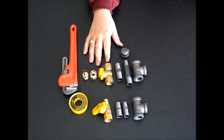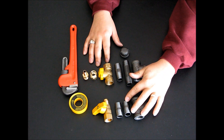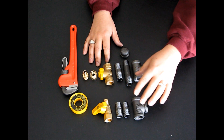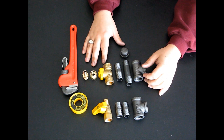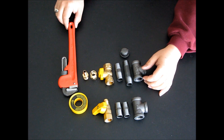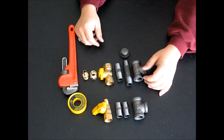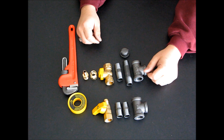Since I plan on running my dryer from this as well, I needed an additional ½ inch tee, two ½ inch by 1½ inch nipples, and a gas valve that allows me to screw on my flex hose from my dryer. In addition to all the pipe fittings, I needed to pick up a pipe wrench and the yellow Teflon tape. Make sure when you're getting the Teflon tape that you pick up the yellow one, because the yellow tape is specifically designed for gas and petroleum applications, where the white is only designed for water.